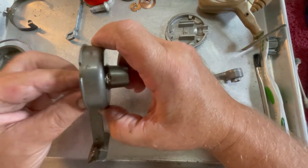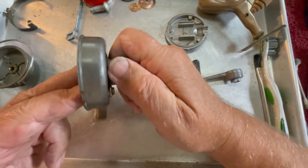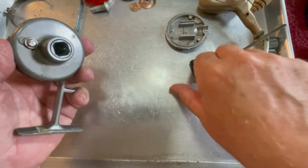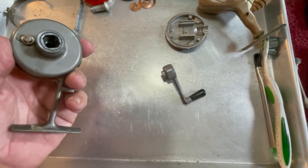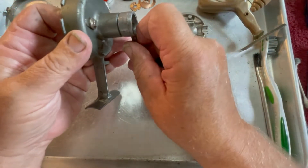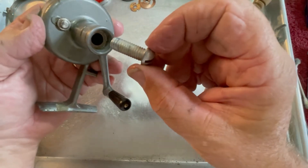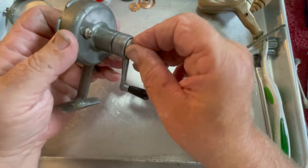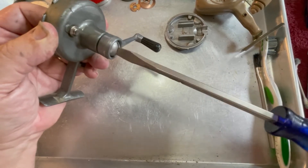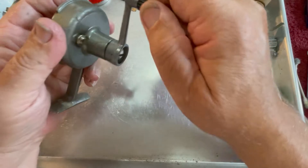Slide that back in — the clicker's working. With that held in place, we're going to go ahead and reinsert this square. We're going to put a little bit of grease inside where this slides in to help ease it in. That slides in, and then we have this gigantic screw — interestingly, as big as it is, it is aluminum, not steel. So let's go ahead and put that in; that should hold all of this tight. Be careful not to cross-thread it. Anti-reverse — we can turn it off.